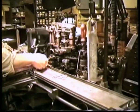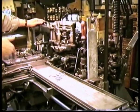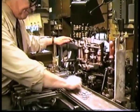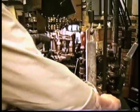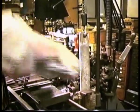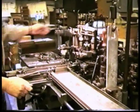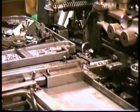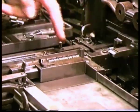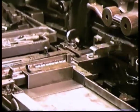This is a caster in operation casting some quads to heat the mould up, and then that's the first line coming out now. That's a metal ingot — mainly lead but there's tin and antimony in it — it goes into a melting pot with a temperature of about 700 degrees. The moving frame on the right holds a matrix case above a mould which is underneath it. The type is coming out along this channel.